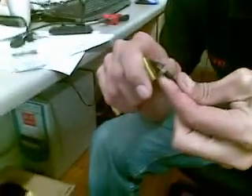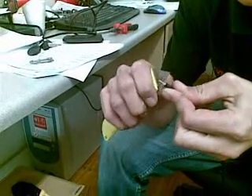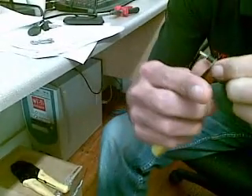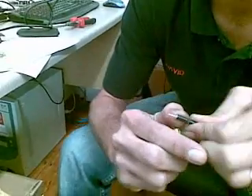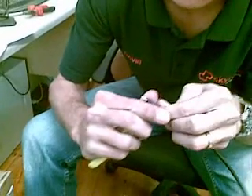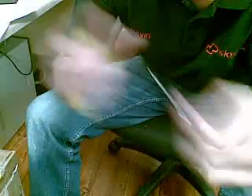It is now on. Just clean off the existing solder that is there — little bits that could touch the outer connector. Then take it about 8 to 10 mil back and lightly cut through the external black insulation.